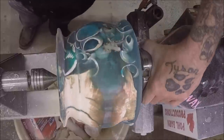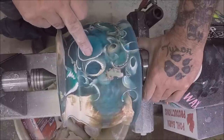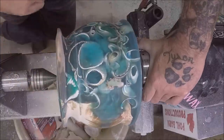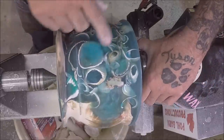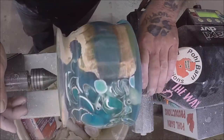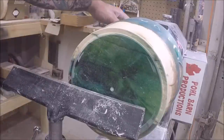I'll try to use the negative rake and see if I can peel some of this extra resin off. I'll sand it up to about 320. There's quite a bit - I just can't get these out. Even if I try to hit it with the tools, all I do is make it worse. So I sanded and sanded, and I got a little bit of chatter and some scratches I can't remove. I'm hoping that the abrasive paste will take care of it. I'm a little worried it's not going to stay on there.